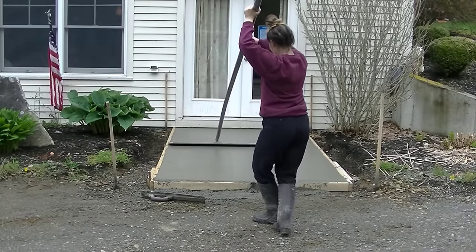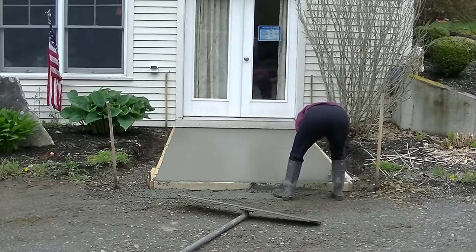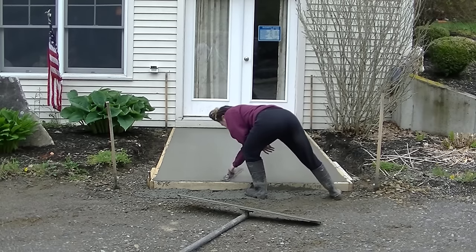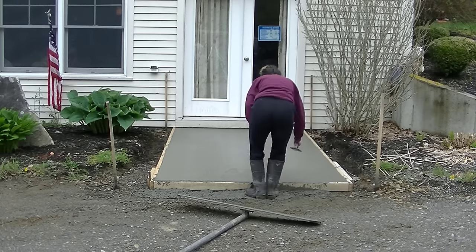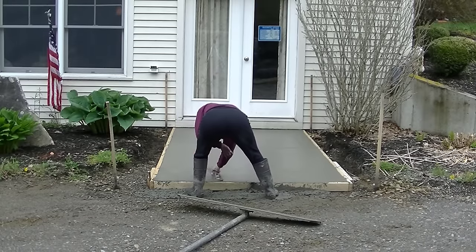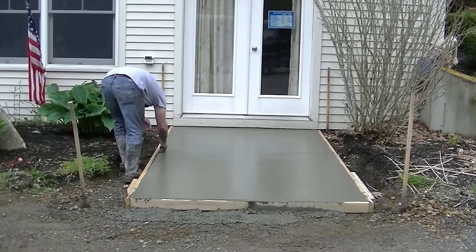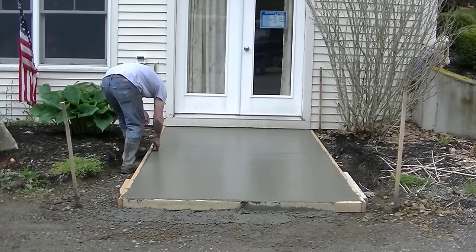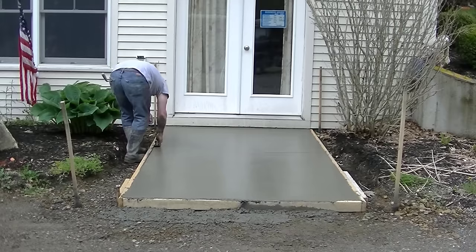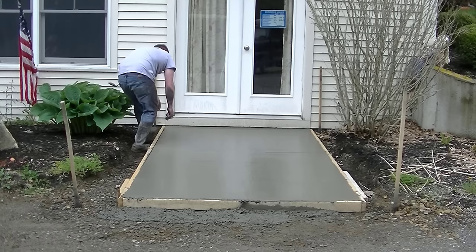Versus when you dry pour concrete, you've got to dump the bags out dry and rake them around — although it's a little more workable when the concrete's mixed like this. Then you've got to screed the concrete, sawing the screed back and forth to make the rocks settle and bring up the fines of the dry mix. Then you've got to use a paint roller to smooth out the screeding marks, and you have to be really careful sprinkling water on the surface so you don't blow away the fines and expose the aggregate. Whereas here, you mix up concrete with a paste and when you mag float the surface, you bring some of that paste up and you can see how smooth that gets.